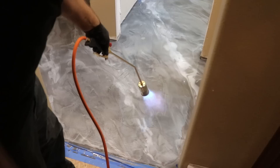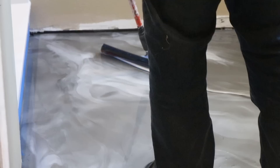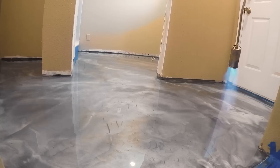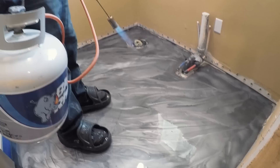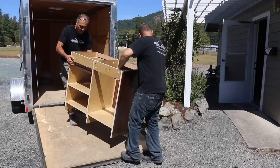Time to hide my tracks with the magic trowel. I got all that air out really well with the torch. It's nice and warm in here so the epoxy is going to set up well, and this is going to marbleize one final time. That floor looks pretty sweet — I love the way it's molded with the grain lines and marble flow. The more you go over it, the more you'll intermix the colors, so don't make mud. Torching those bubbles is key. If you have really porous concrete and need two seal coats, go ahead and do that — that's a pro tip.